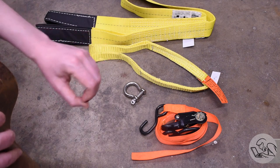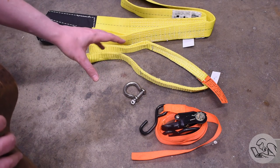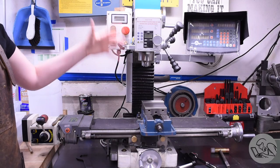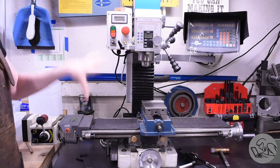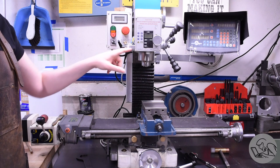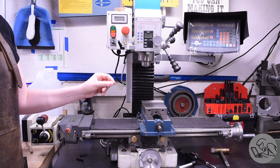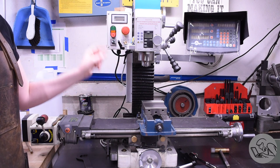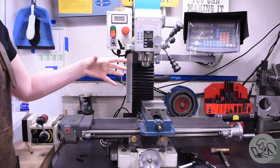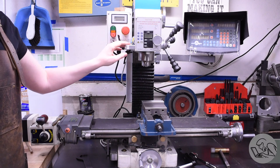When lifting heavy things, don't ever put anything underneath it that you don't want destroyed, and always focus on controlling the load — don't let it swing. So how do you know how to lift the machine? It's not super obvious what's safe to pull on. The answer is simple: read the instructions. The manual for the machine will tell you how the machine was designed to be lifted. Sometimes that'll be unintuitive, but they've designed it that way, so follow what they've designed and you will be fine. Even if you've got an old machine that you bought used — maybe it's 50 or 100 years old — go online and you will find the manual for it somewhere.